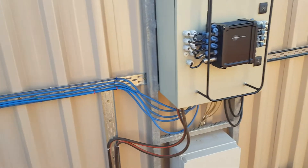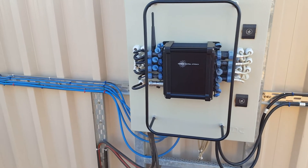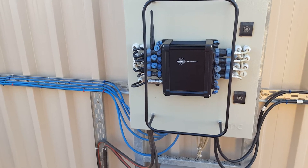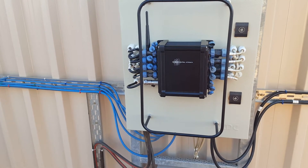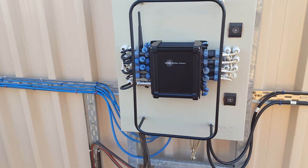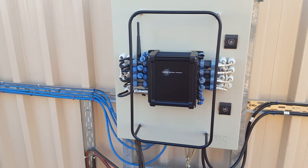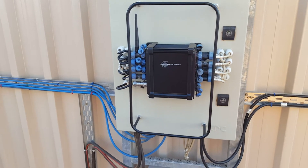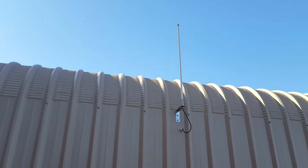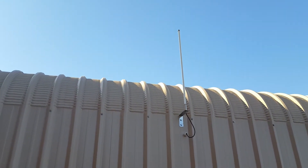All this is done through the little piglet over here, which for this application is basically just a remote terminal unit. It's got enough processing power to run the digester on its own, but because we cannot change parameters on the piglet, we've made it so that it speaks to the Warthog situated inside the pump room. The antenna you can see there is the method of communication — there's no cable between the two units, it's only via radio. This antenna here is the communication link between the piglet and the Warthog.